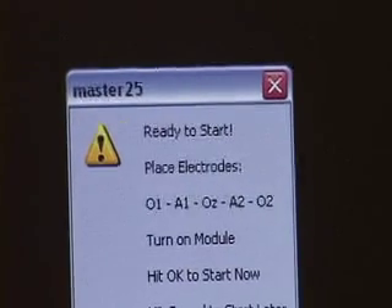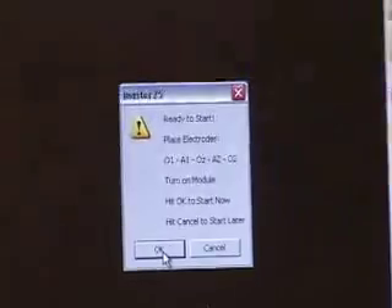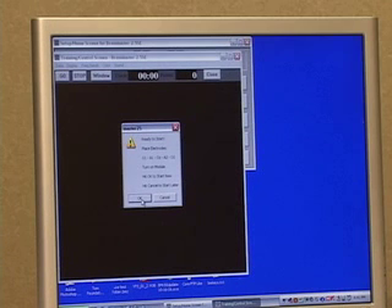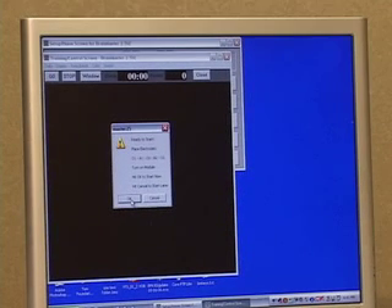So just to sum up: module not responding is usually a battery problem. Our battery could be either low or completely dead. Even if you see a bright red light, it can still be low. The light itself only takes 1.5 volts to fully illuminate, yet the system needs 7.5 volts to communicate with the PC. Thus, from 7.5 down to 1.5 volts, you'll have a bright red light but will not get communication, and you will see the module not responding error.